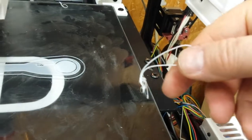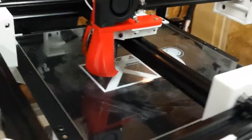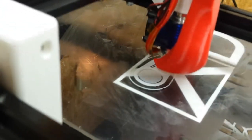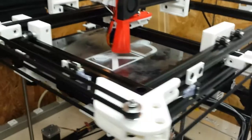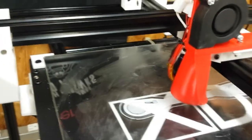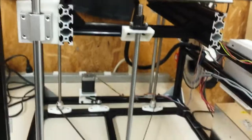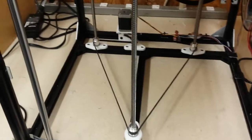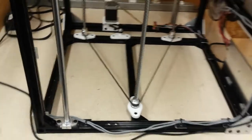This piece that I just took off was a swipe that occurs at the beginning of each run to clean the head and make sure that there's no remnant material that can spoil the print. Now it's starting to do the second layer. You can see it's starting to develop the shape of the part — this happens to be one of the double-ended ratchets that I'm told was developed for NASA. You can see the glass bed. This machine has an envelope of approximately 12-inch cube — 12 by 12 by 12 — or really 300 millimeters cubed, which is what many of the parts I was able to find were dimensioned at, like the glass bed. That hasn't been a hindrance; it's very close to 12 inches.